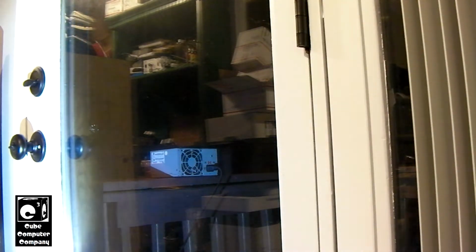Again, one more time. The reason I know the primary charges up on this one is because I see the lights dim down for a sec. I'm going to give it a few seconds, let those primary caps discharge. We'll see if I get the flash from the lights again. Yep. Okay, so we're not getting 5-volt standby. Not sure what's going on there. Okay, this time I'm going to power it on with the door open, see if I hear any noise from it.